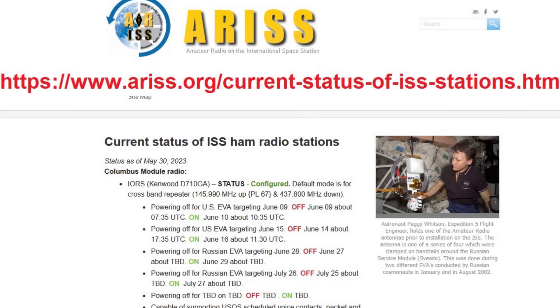The very easiest way to hear the space station is to take one of these radios, tune it to the right frequency and wait for the station to pass overhead. The one I'm going to be using is 437.8 megahertz, and that is the main UHF ham radio downlink that's cross-connected over to a VHF uplink. This is what's known as a crossband repeater — 2 meter VHF going up, 70 centimeter or UHF coming down — and these little radios can do both.